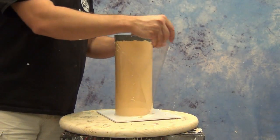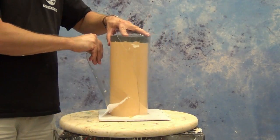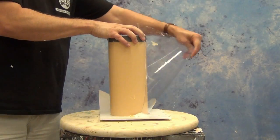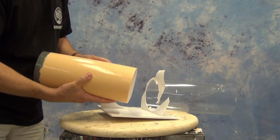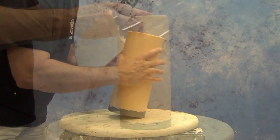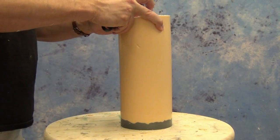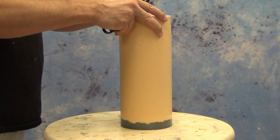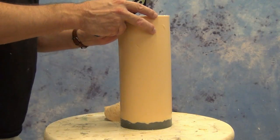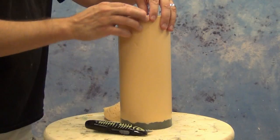Now ready to cut off the mold tube, and since we are demolding a resin positive, we'll have to tear the alginate off of that positive. Unlike casting silicone into an alginate mold — where sometimes you can pull out multiple silicone casts without destroying the mold — in this case we will have to destroy the mold, especially given Wendy's hand position. She's making a claw shape with her hand so she can sculpt a prosthetic hand over that resin core.